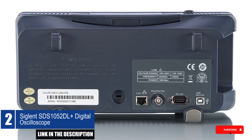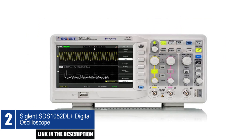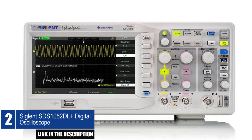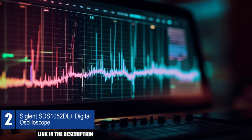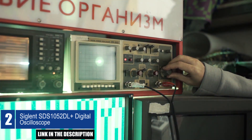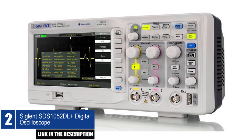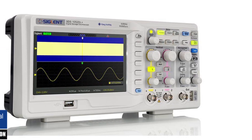The oscilloscope includes a new higher-resolution display and several useful features, such as cursors, math, a built-in frequency counter, and 32 types of auto-measurements. Furthermore, it includes USB and LAN interfaces for easy data transfer and connectivity. With normal memory of up to 2 Mpts and a zoom function, it offers users superior functionality and flexibility. Its pass or fail function and five-parameter display add to its value for product quality control, education, and training purposes.